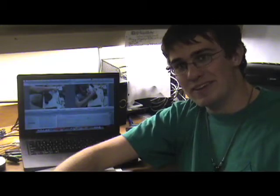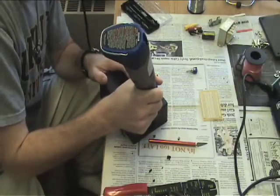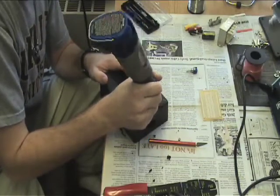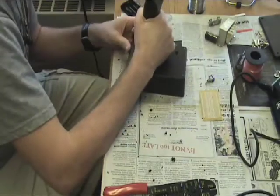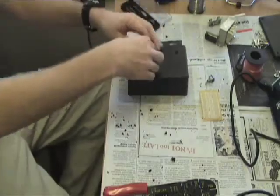Alright, now let's build the thing. To start off, I pull out my trusty Dremel tool and cut holes in the casing for the extension cord, binding posts, and switch. Be sure to also drill holes for screws to mount your transformer, as well as a hole for your LED power indicator. Then insert your parts and add the appropriate mounting hardware.